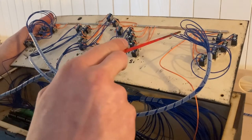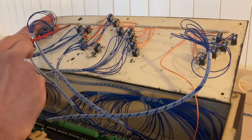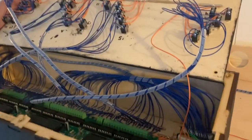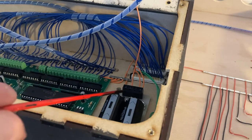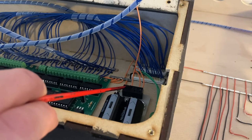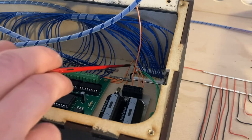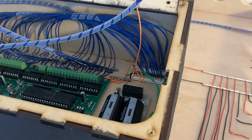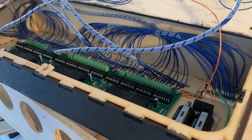That runs up to this strip of copper clad, which I've mounted at the top here, or the bottom as it is once it's down, and then that links back via this wire, and that runs down, if we follow it down, to the capacitor discharge unit. So we've got two outputs from the capacitor discharge unit here and here. This one goes straight to the switches, which is one side of the point circuit. This one runs out onto this strip of copper clad here, and it is then linked through back onto the layout on the common terminal, and it also runs to the opposite end of the control panel and goes through on the opposite socket as well. Not that you can see that.